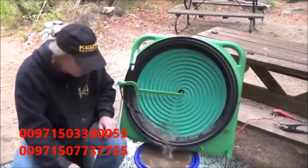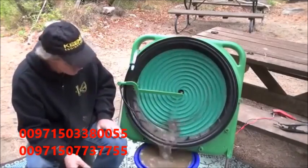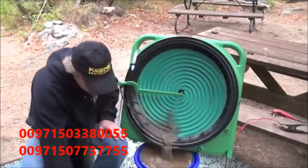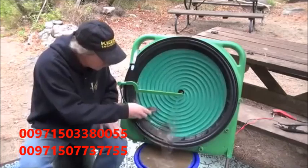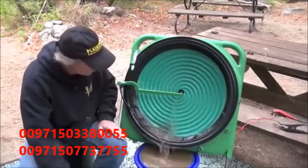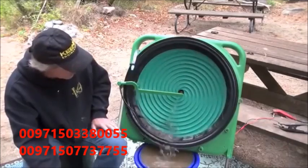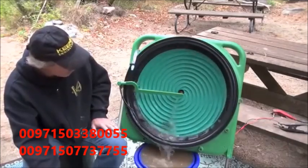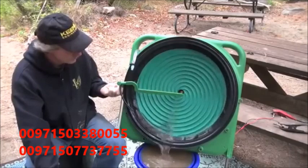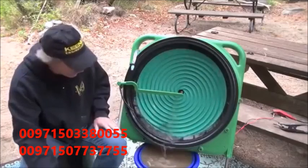I still don't have it quite adjusted right — I'm watching how the material works. It looks like the black sand is building up in the bottom ribs, and I have a little bit too much water. So I'm going to cut my water flow down just a little bit. Now I'm actually seeing the black sand climb a little higher, so let's see how it works. In reality, I would much prefer to have the material pre-wetted first — have some water in the bucket and possibly even a little wetting agent like Gold Drop, Jet Dry, or some kind of a non-sudsing detergent.